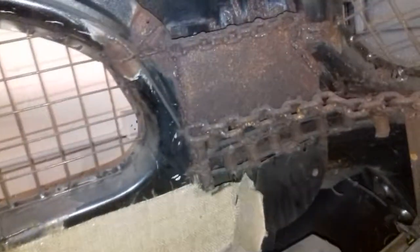We've got a handbrake mechanism down here — you can't really see until we go underneath. The handbrake here is, believe it or not, the original handbrake from the taxi. Behind here there's a fuel tank — it's a stainless steel fuel tank — and then we've got a fuel gauge here. This obviously just shows you the level of the tank. I've worked it out — it's about a 12-gallon tank. Underneath here there's a fuel cutout, so there's a fuel pump under there — they cut out and isolate it. So if you wanted to isolate the car without anybody stealing it, you could.